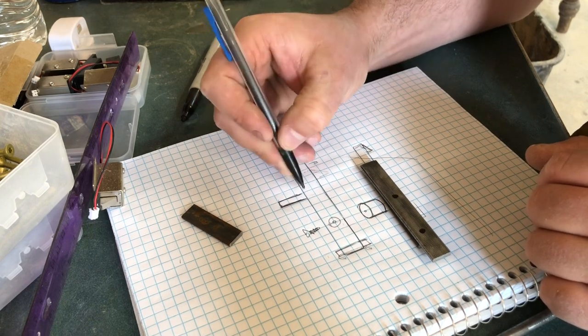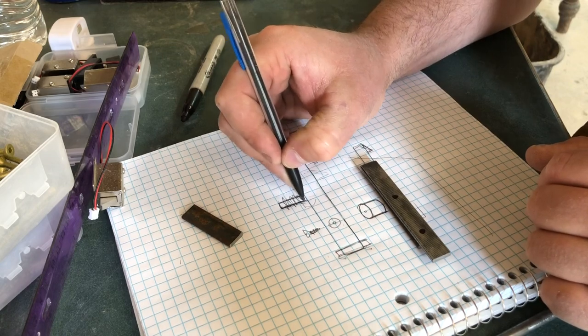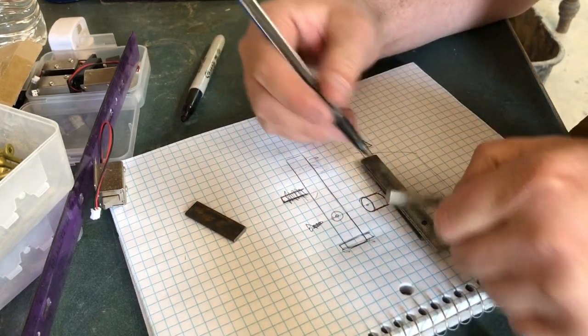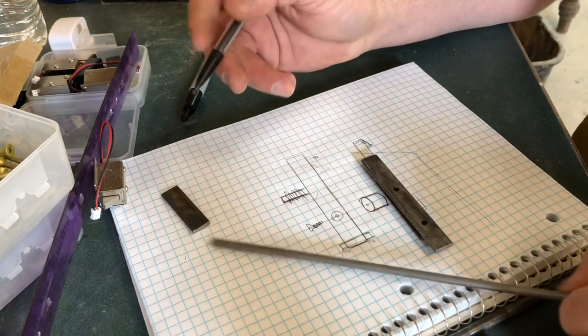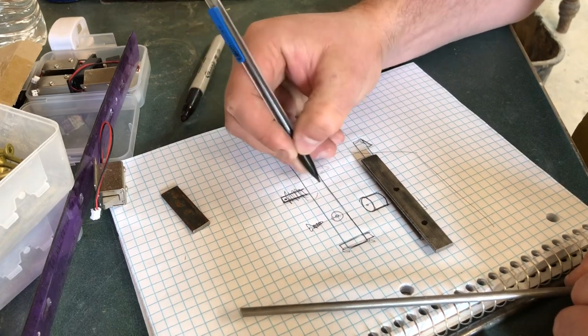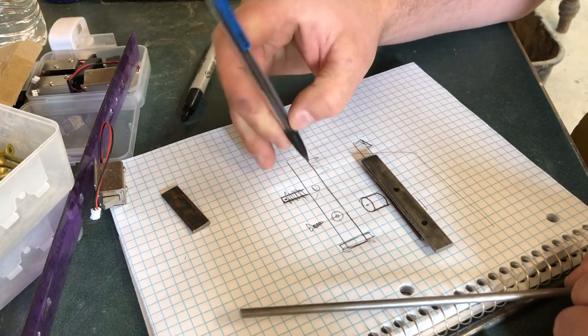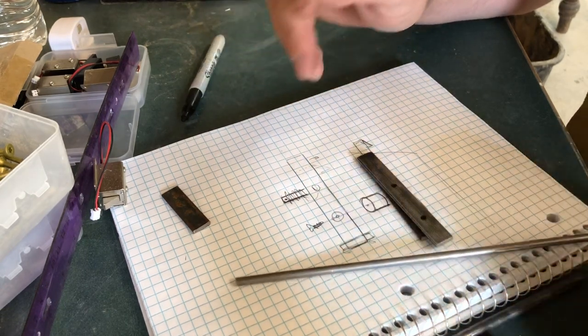So if that comes in that, obviously the view is flipped. And then I put a spring here on that little nub coming through here. I'll actually use a smaller metal bar. Drill a little hole here, put a cotter pin to hold the spring down. That will hold that down. And so that when I push here, I still needed to pivot here though.